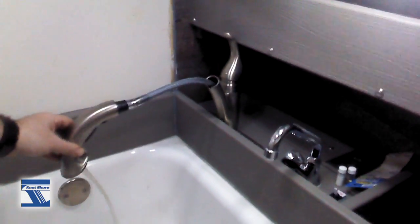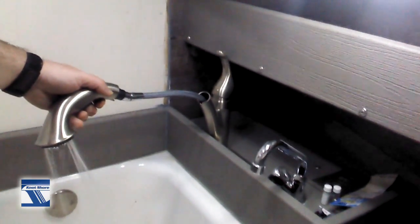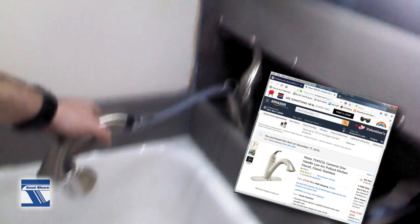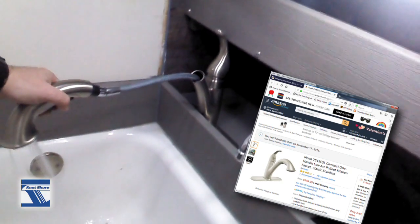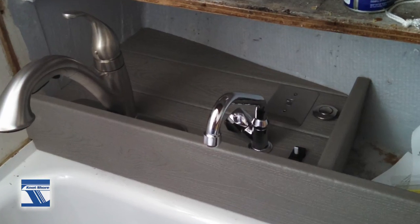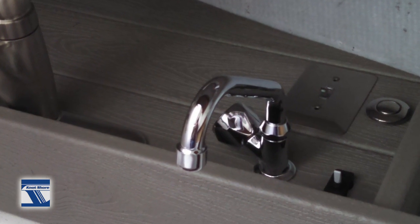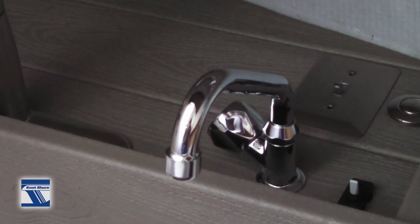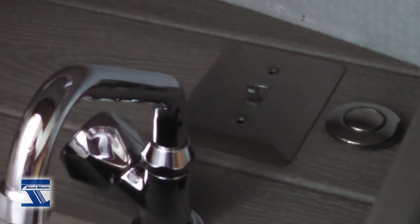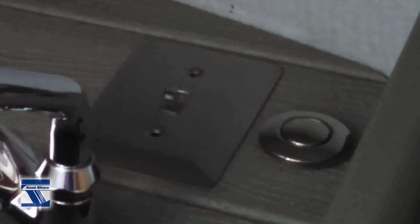I had to find a way to get up to the tub since I made it pretty high, so I had to build a platform to actually get into the tub. There are two types of faucets — one is a freshwater faucet with an extension sprayer handle that pops out with a couple of spray settings, and specifically one with a little button so while you're holding it, you can shut it off and turn it back on — kind of a remote start-stop. That's the fresh water from the freshwater tanks. The other is a raw water faucet with a separate switch that pulls from whatever water we happen to be sitting in — hopefully Bahamian water. I also mounted a switch for the heater in the same area. The heater doesn't heat the water up; it just maintains the heat that's already in there.